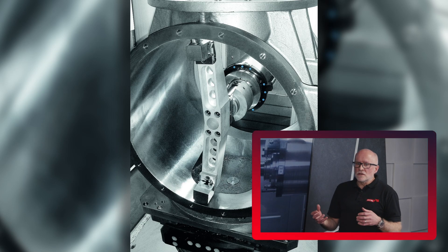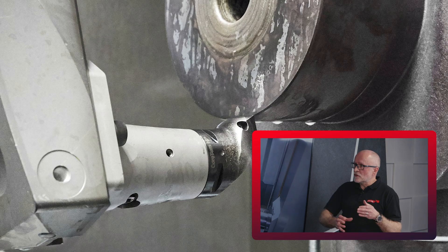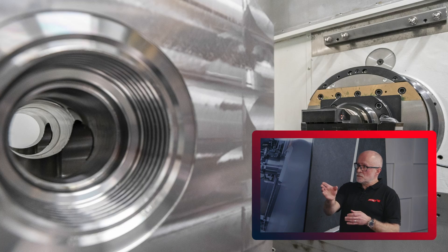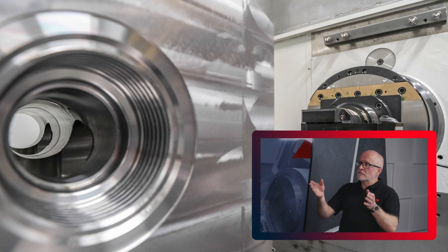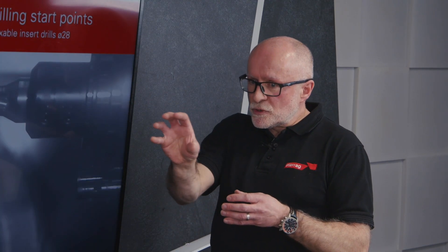There are. And often you're working with fluids, so there are certain surface finishes that you need to achieve. For example, you might need a gramophone finish on the front of a flange that you need to turn rather than mill. There could be a lot of internal bores with multiple diameters, chamfers, radiuses, and different forms. So you need to be able to reach in and produce all these features in a single setup, including the gramophone feature.